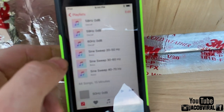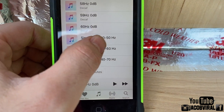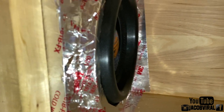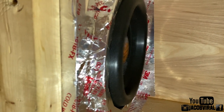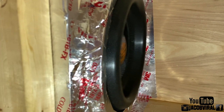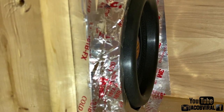If you want to make it really quick, you can just do a sine sweep. I'll do that real quick - you can use a sine sweep from say 20 to 50 Hertz, and that'll show you close to where your subwoofer is moving the least and most. It's really hard to see at low volume - that's why I recommend doing high volumes for this.